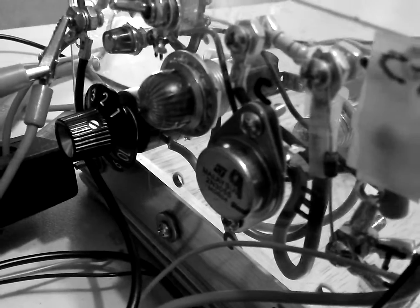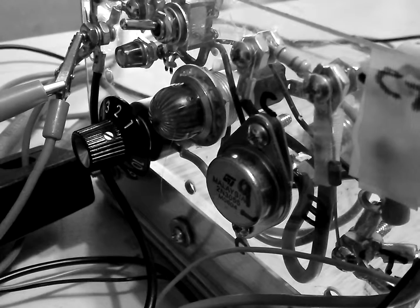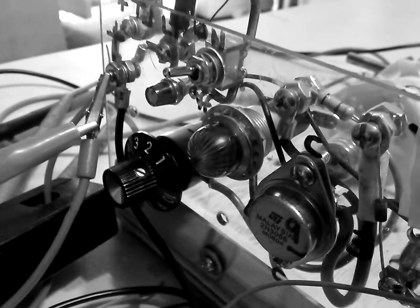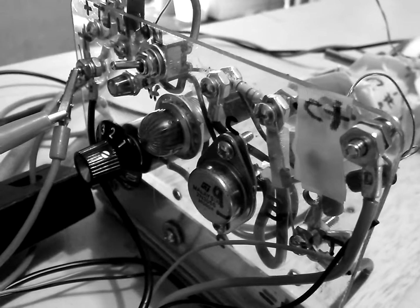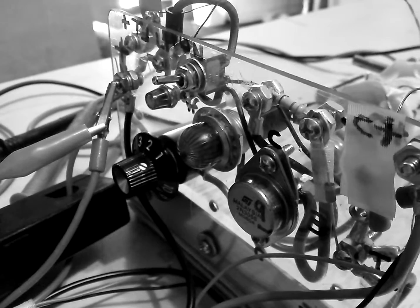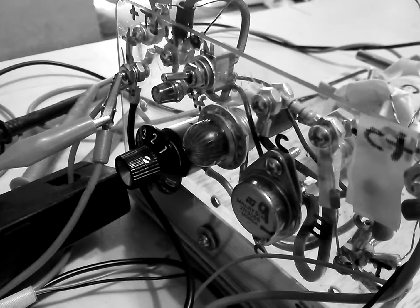Anyhow, what happens is if you put this transistor on a heatsink, depending on the size of the heatsink, we had a fairly massive heatsink, the voltage increase of the flyback was so great that we had to put another battery to charge another battery through the diode circuit of some of John Bedini's advanced stuff. This was designed for the schoolgirl without any charging capabilities, but just by mounting this transistor on a heatsink, the flyback was so great that the neon light came on. By the way, there was no neon light on the original schoolgirl because he didn't need it.